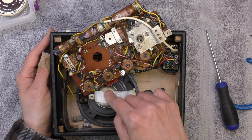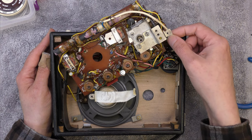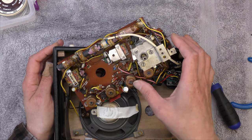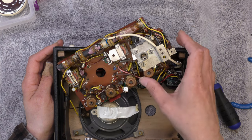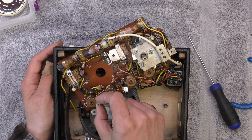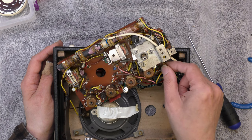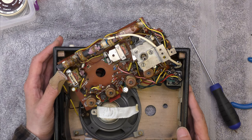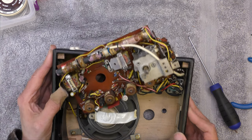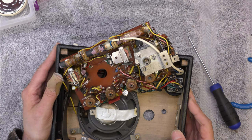Oh, do I see Hunts? Oh goody — it's full of Hunts capacitors. So it's a transformer design — two transformers. There's the ferrite rod connection to the car aerial. These very familiar copper-wound IF transformers, and it's got NKT164s in it — Newmarket transistors. I'm familiar with the bias adjuster.